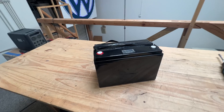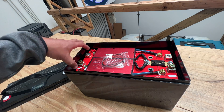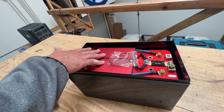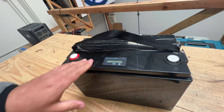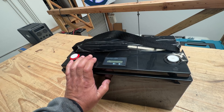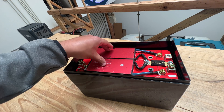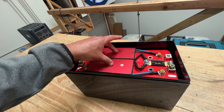That is what my 12 volt battery is going to look like. This is going to be a small battery — it's eight cells times eight amp hours, so it's 64 amp hours, 12 volts, but it will be able to do 200 amps. Now, I know this battery looks like a regular car battery, but at 200 amps this battery will probably not be able to start a traditional car — I think you need more amps than that. These BMSs will get triggered on a large surge, probably past like 200 to 300 amps, and they'll shut down.